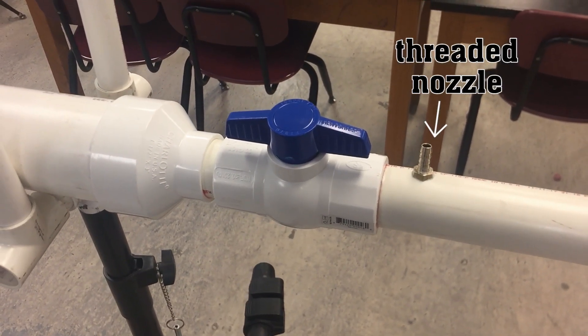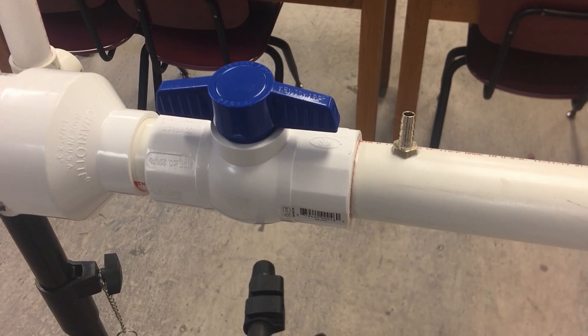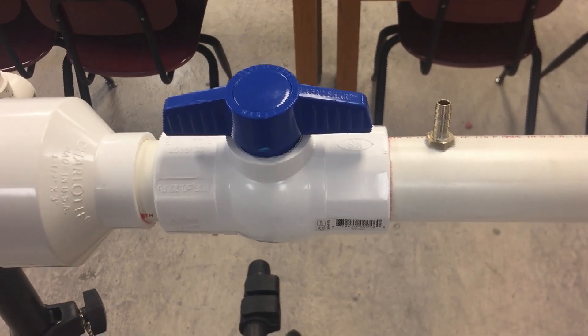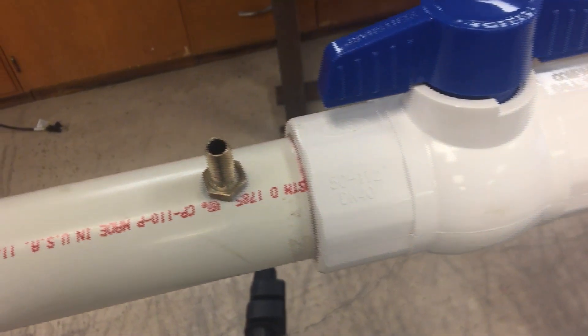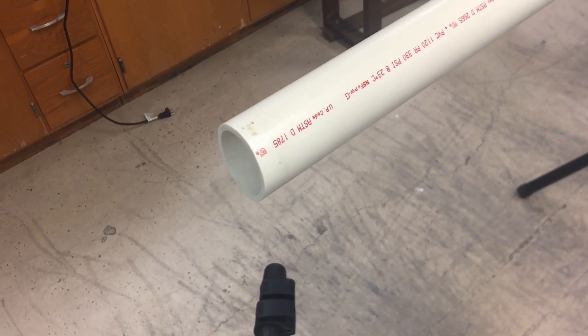In the front half I have another valve stem where I attach a hose and vacuum line going to a vacuum pump. After putting the ping-pong ball down the end, I seal it with aluminum foil — three layers of regular grade, not heavy duty — duct-taped onto the end. The pump pulls a vacuum, and once the desired pressure is reached, the ball valve is released and pressurized air moves into the vacuum chamber behind the ping-pong ball and shoves it out the other end.